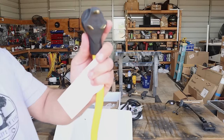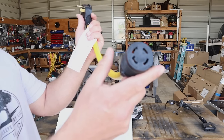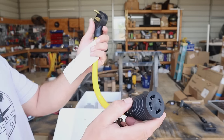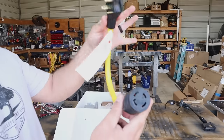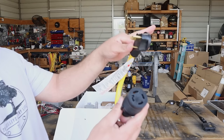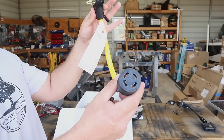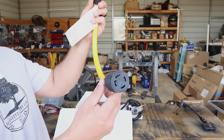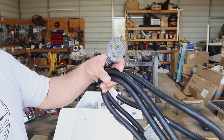You can see it's three wires from the generator, four wires out right here. The jumper actually sends hot to that red and black wire that I showed you inside that box. So this plug right here just took care of the problem for us. We don't have to do any extra wiring inside of the panel to run on a 120 volt generator right here or a standard 240 volt generator.